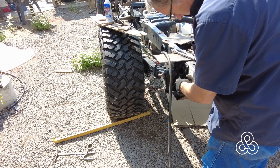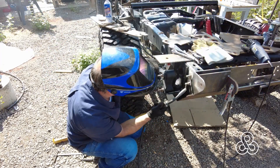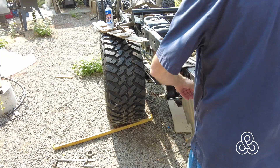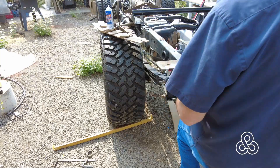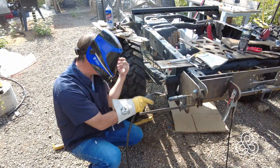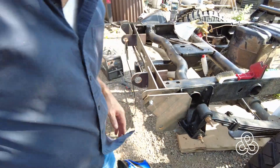The reason there are going to be two end plates is because they're going to make up a bit of a bracket for our out-drive system that's going to pivot on those corners. Once these nuts are on, I can cover that area up — I'm going to put this outside plate on. I've got to cut a little piece of tubing for the right spacing on that, put a bolt through where the pivot point is going to be, swing that plate into position, clamp it nice and parallel, and then go ahead and tack it in place. That little pivot point is going to be for the flotation tanks that have out-drive motors in them that will lower down when this thing's in amphibious mode.